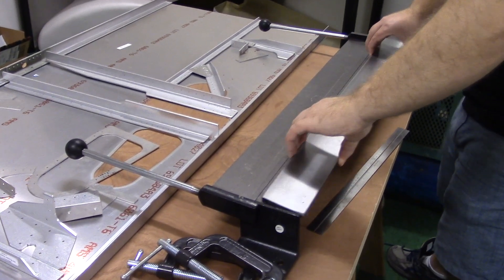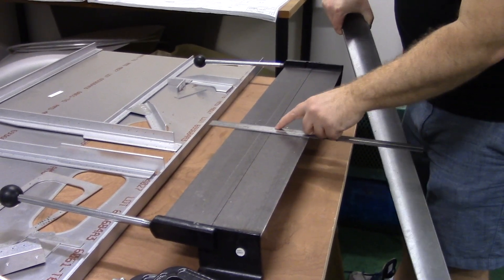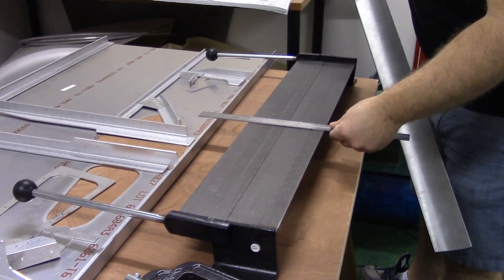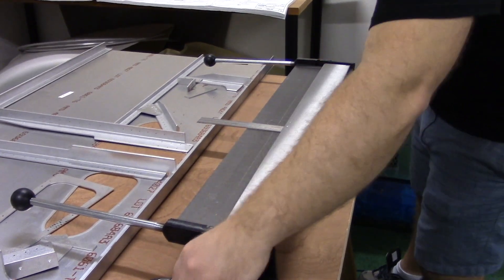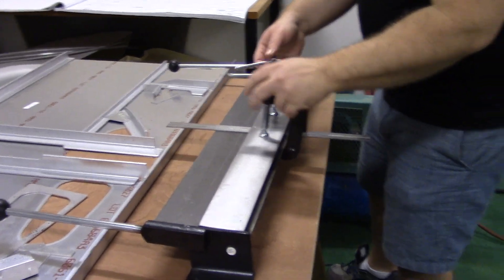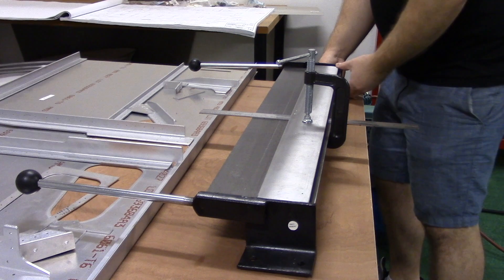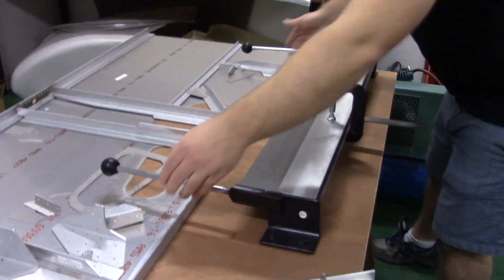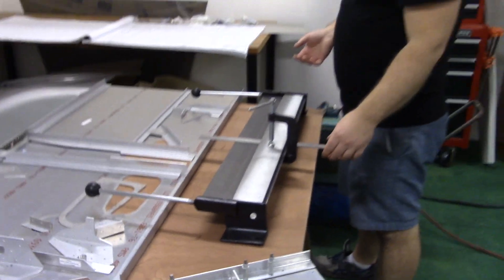So how the bending brake works, if you haven't seen it before: you put your piece of metal in, find out where you want to bend it — like the five-inch or seven-inch line — then you put the additional piece on top and use your two C-clamps to hold it down and tighten them in. Generally you'd have a little clamp to hold the brake to the surface you're working with. Then you grab these two pieces and pull up to bend it. That's how I bent that piece from earlier, and now they're working perfectly.